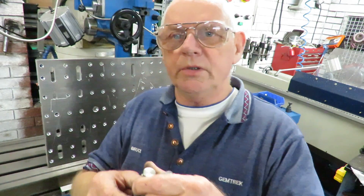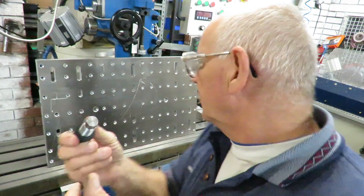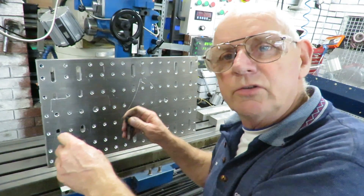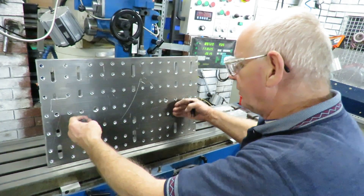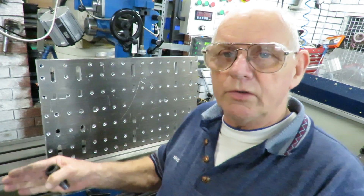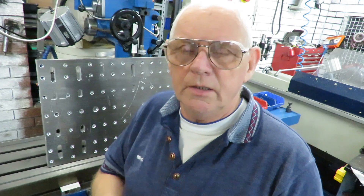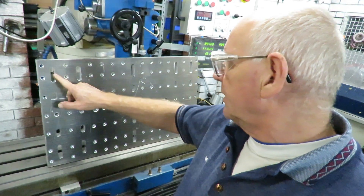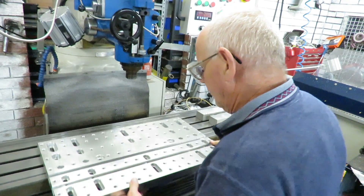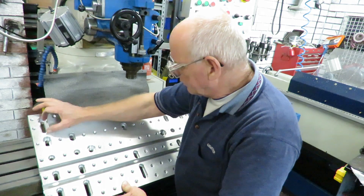I'm going to trial out the two little bolts that I've made, to set them up in the grooves. I made these two bolts and the intention is, on the other side here, these two places will screw down and fit into the table groove, allowing us to line this up and centre it. Because the grooves are different sizes and different distances apart — they're all 16mm or 5/8ths grooves but at different centres. That's why I made these channels here. So I'll flip her over — there we go. That's the plate. Now we've got to make these other two trenches.